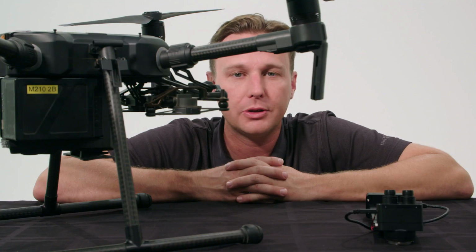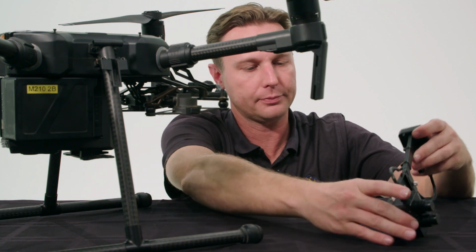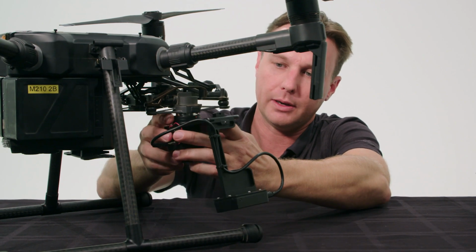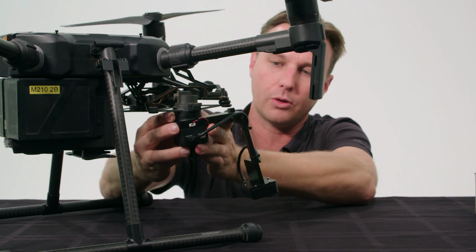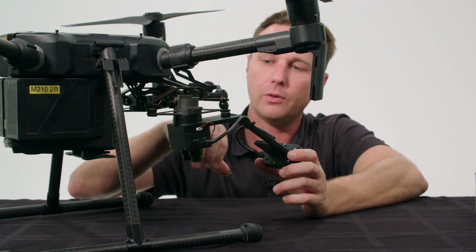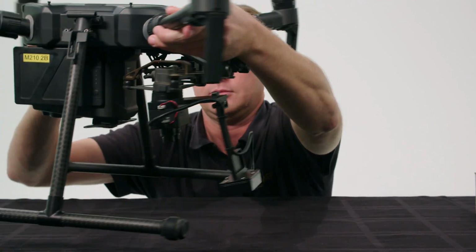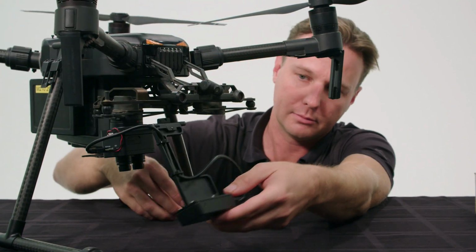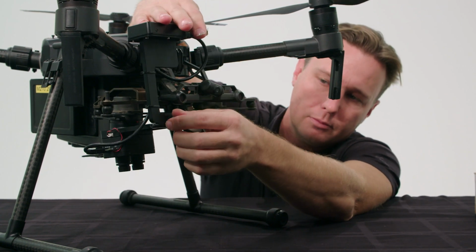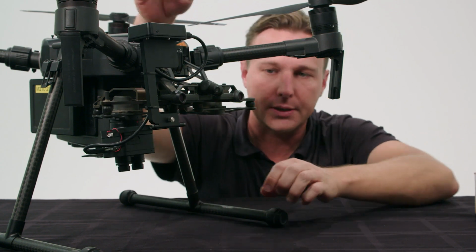Your Sony Ag Solutions camera utilizes the skyport on your DJI drone for its power. To install it, line up the white dot to the red dot and do a 1/4 turn on the number 2 port on your Matrice 210 or the single port on your Matrice 200. To secure the GPS bracket, flip it up and secure the set screw, and make sure it's snug.